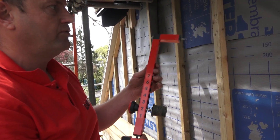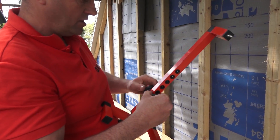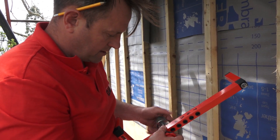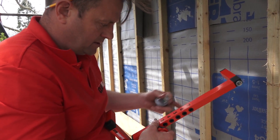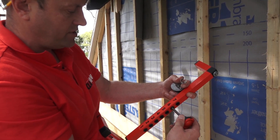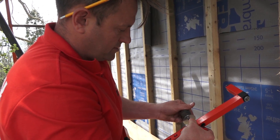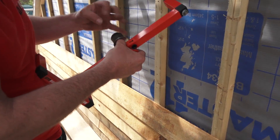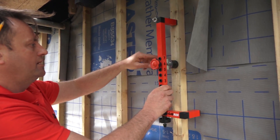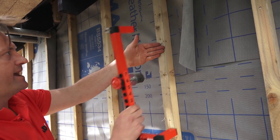The two top ones are actually for when you're underneath a soffit. So what you would actually do when you get to your last board and the soffit's in the way — we undo that, and then whatever your last board is, whether it's six or seven, just say it's six, so we put that in. So we're underneath the soffit — we can't get any further — but what we can do, we can put the last board in, and then we take that out and put a rip in.